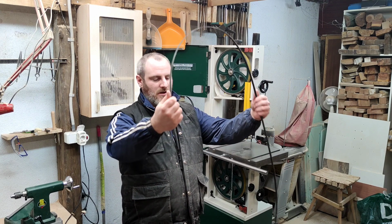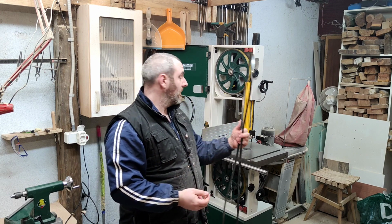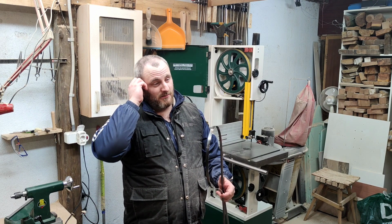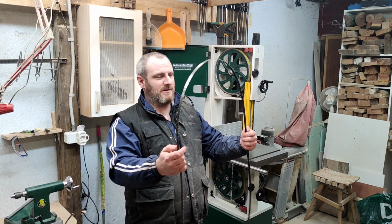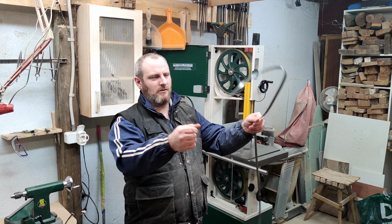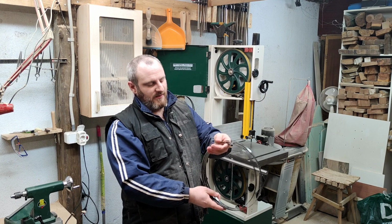So I'll show you again. The upper third of it. Now this can obviously be applied to maybe a 24-inch bandsaw blade, but this is 14 inch. The bigger they are, obviously there are other procedures you can do, but for bandsaws from 14 inch up to 24, you can do it like this, and this is what most of us used, even the industrial shops. So grab the upper third, teeth away from me, roll it and twist it, and you get this small coil, which tries to get to its place, and they fold.